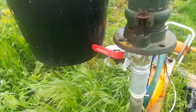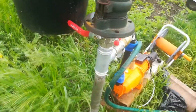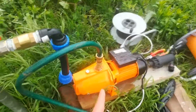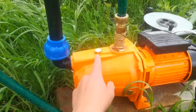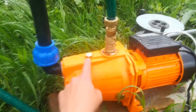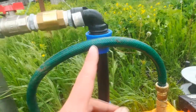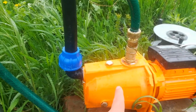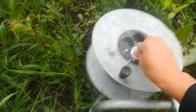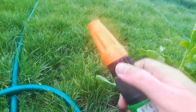Use this lever to close the valve right here, and then the pipe stays primed for the electric pump. Initially when you first set this up you need to have water poured in and prime the pump, but after that you no longer need to do that if you have no leaks. This pump has been primed for two weeks now — you just plug it in, the pump starts, and you can start the garden hose.